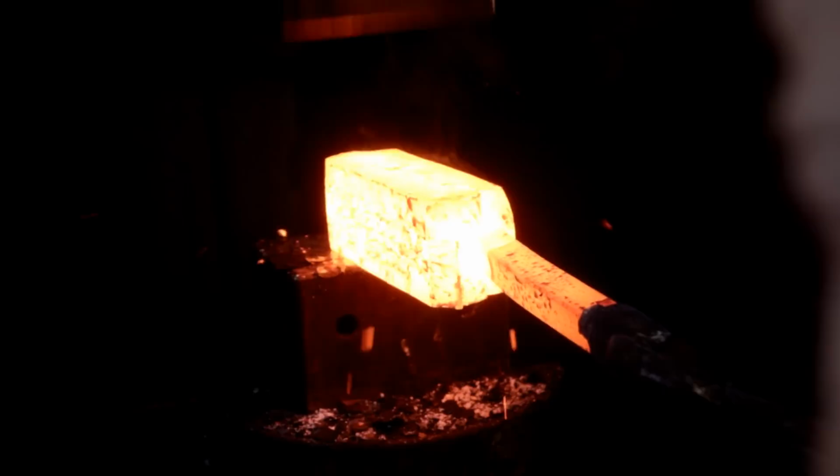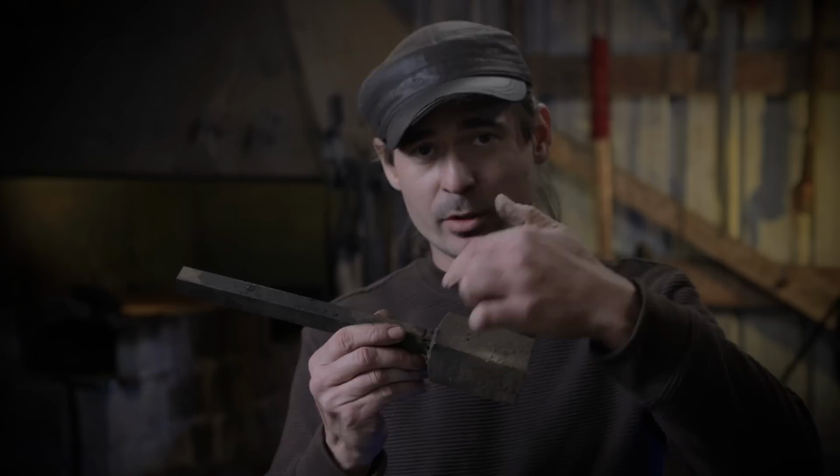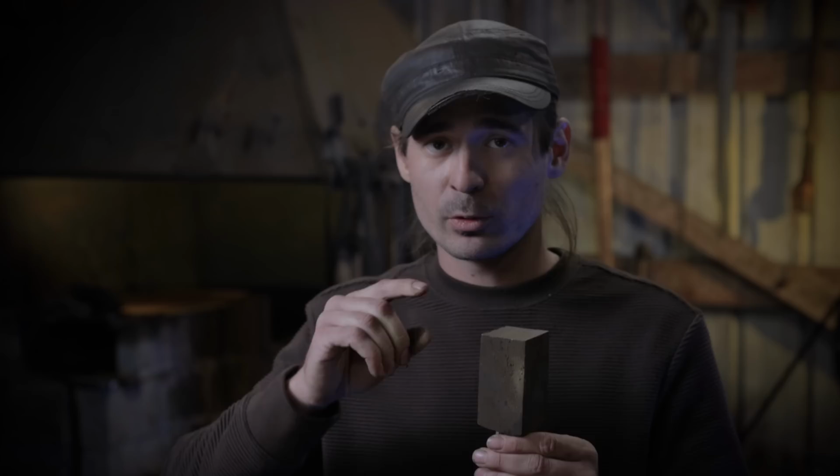So the project starts out the same trite way as any Mosaic Damascus project begins. We make a Mosaic Damascus billet, much like this one. And what we need to do is cut off this stick and stand it on its side, or rather bottom. I use the power hammer to start squashing it gently and a series of top tools to control in which direction it is stretching until I have a pancake, something like that.